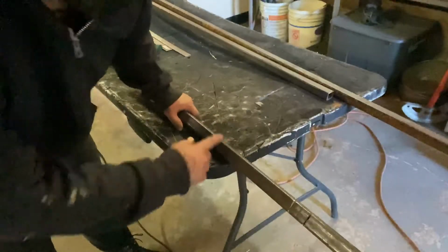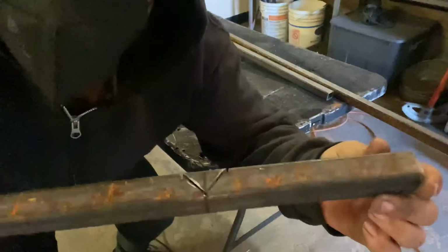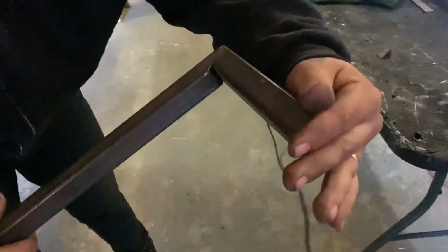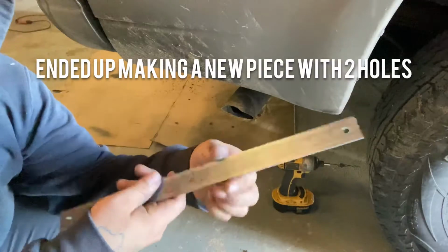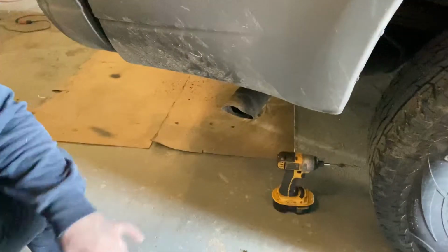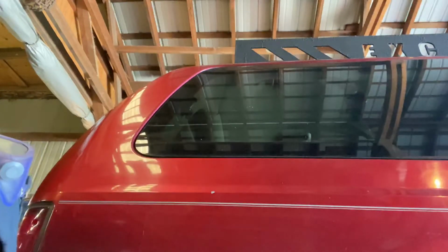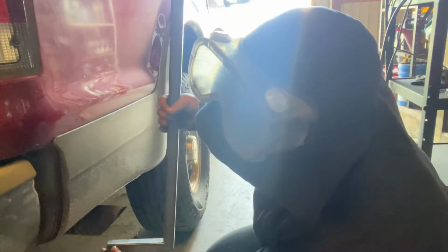We're using 1-inch square tubing for the ladder, and I've cut this section right here. That way I can bend this into a 90-degree angle. I've drilled 3 holes in here. I'm going to be fitting this bolt and nut onto the bottom of it. From there, basically work all the way up and create the bottom and middle of the ladder, and then we'll end up here.